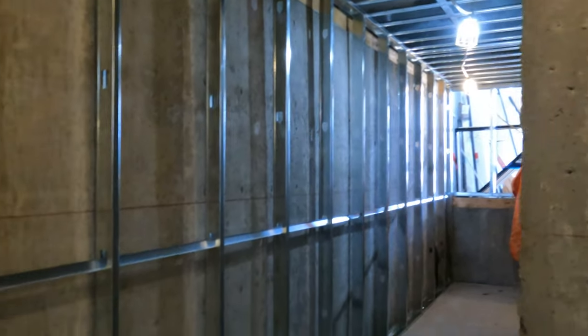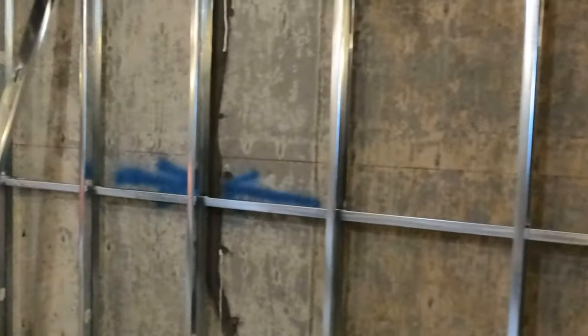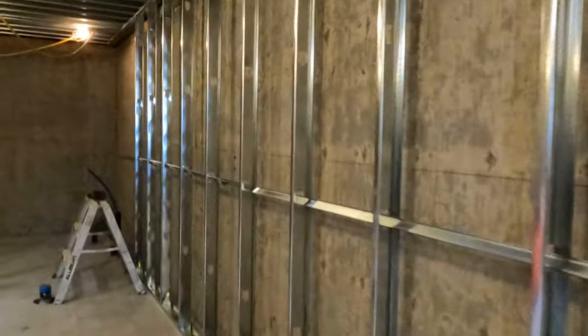As you put the walls in, make sure you get your channel in — it's important because all these walls will be insulated and you need to hold the insulation up. The main point here is you need a continuous seal of drywall all the way around the perimeter. I'm going to have a floater to tie in that corner, giving a nice seal all the way around the perimeter. Get all your bottom track laid out.